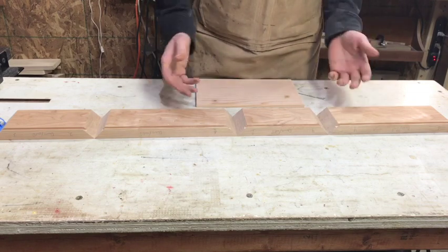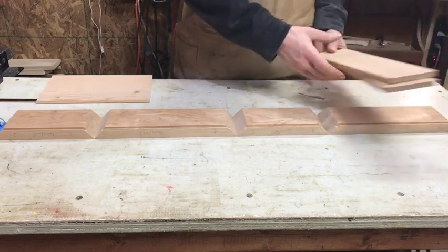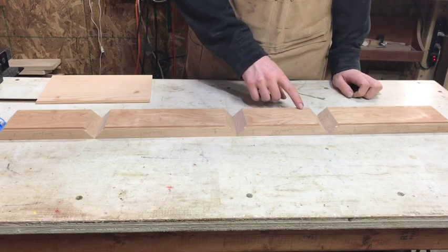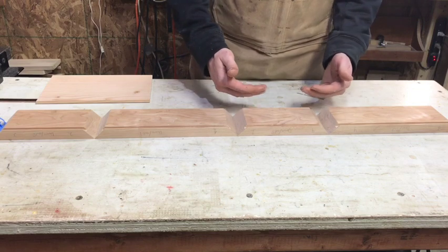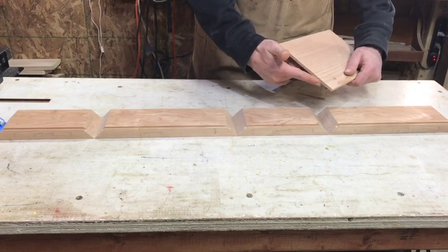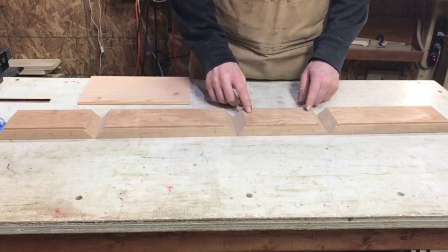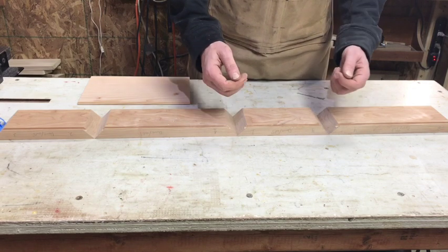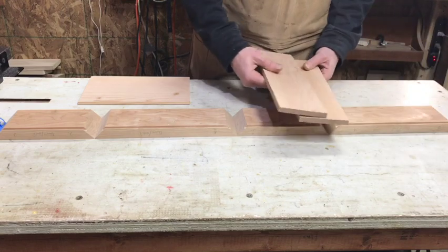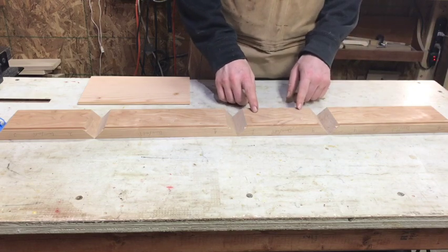If you think you may have any problems with your lid — whether it's a panel or a single board with a cup — pay attention to the back piece. Sometimes you want to make the groove on there slightly lower so the lid can ride up into it without hitting. You can also round over the back of the lid so it rides itself up into there. It's never a bad idea to make the back of the box a little lower to give room for the lid to slide in. Think about this ahead of time, which is why I often think it's good to have your lid made before you cut the top groove.